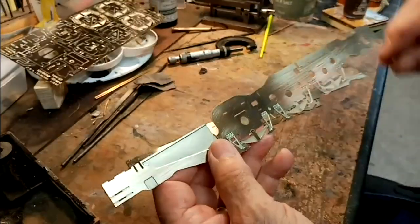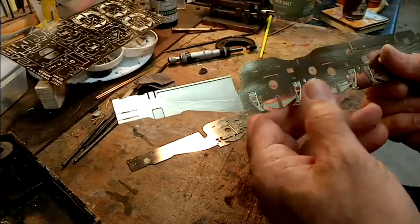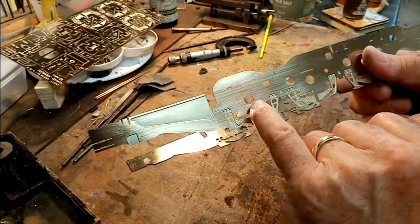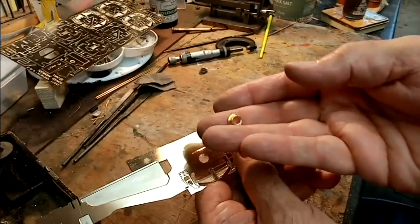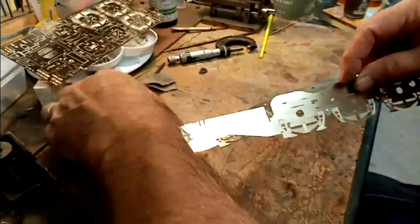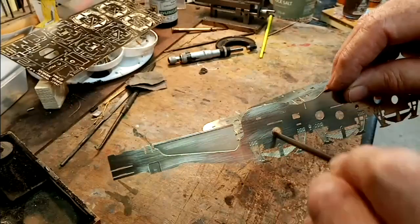So what I do, coming back to the back axle, is going to be my driver, and that's going to be a fixed bush. What I've found is that this hole is slightly undersized for the bush, and the bearings are 275 thou diameter. Well, I haven't got a reamer of that size, so I've just very, very carefully taken that. It's only a thou or two, just taking a thou or two out with a half round file, just filing round and round.